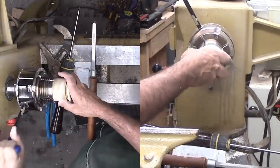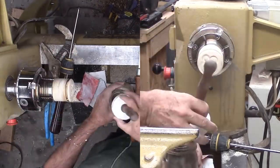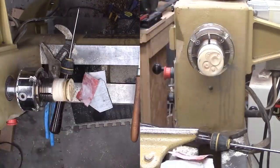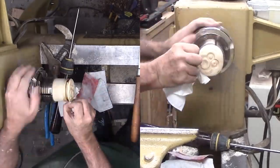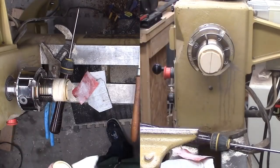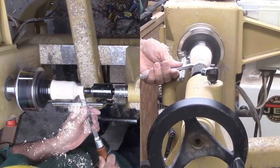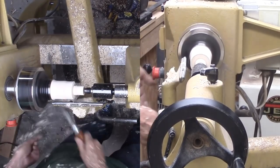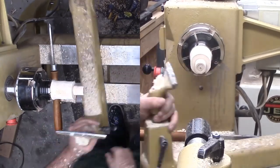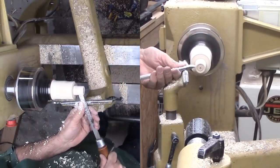When all features are finished, I'm returning the work platform to my chuck for final sanding and finishing with brushing lacquer. Repeat again for another medallion for the other side. Now for the neck of the vase. Again, I'm using hazelnut from last year's pruning — it's dry now. Since I have to fit it to the top hole in the vase body and I want to test fit it before finishing on the lathe, I have to adjust my plan.